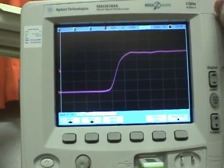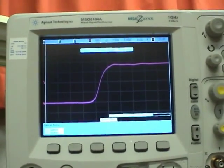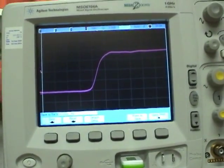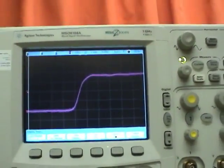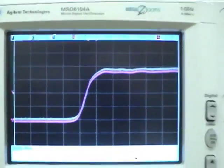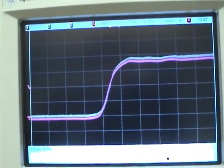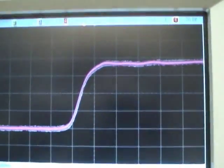And the zoomed in one. And I'll just persist this so we can quickly check when I swap the probe over. And we can do that right now. Okay, new amplifier is on, and the waveform looks quite similar, except there's a little bit of offset, so I think that's normal at these very low volts or amps per division range. Just increase it, zoom it up, move it up. That looks pretty close.